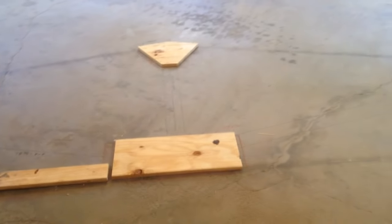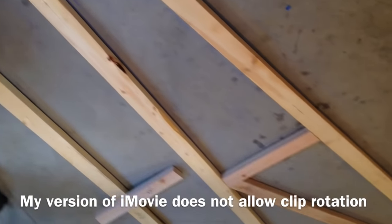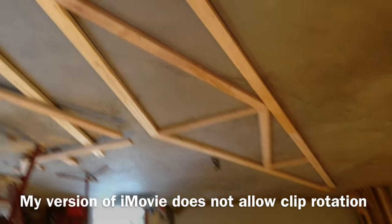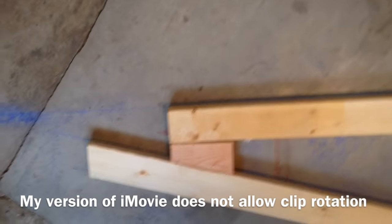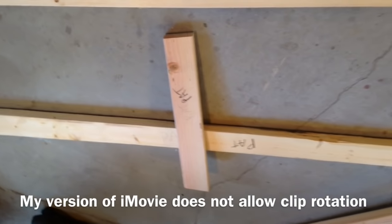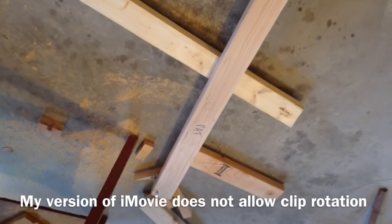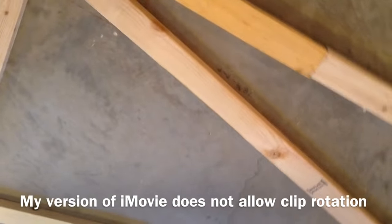The actual truss pieces themselves are about nine pieces: two pieces of bottom cord, two pieces of top cord, this member right here, and two of these that connect down here, and one vertical post. We've got all the parts for the first truss cut and assembled and we're ready to glue it up and nail it up. There are actually a total of 11 parts — I forgot about these little filler blocks on each end. For all the parts I've made, I've made patterns as well, so I can easily duplicate them from here on out. The top cord has a plumb cut on each end, and then there's the king post in the middle.